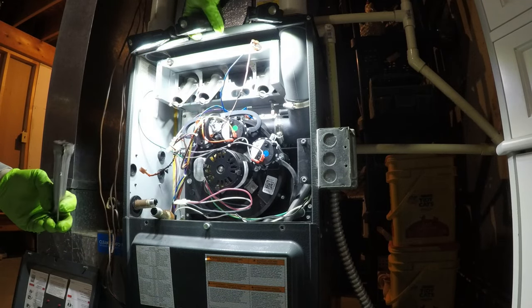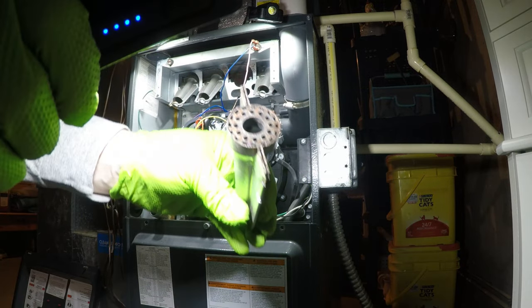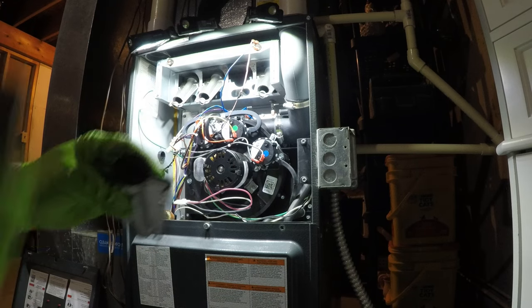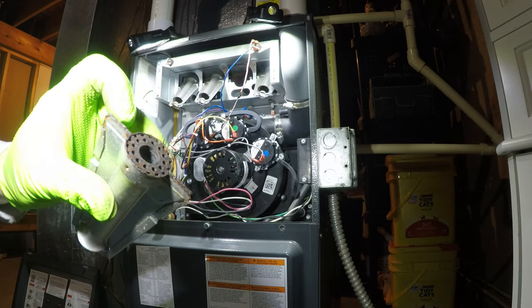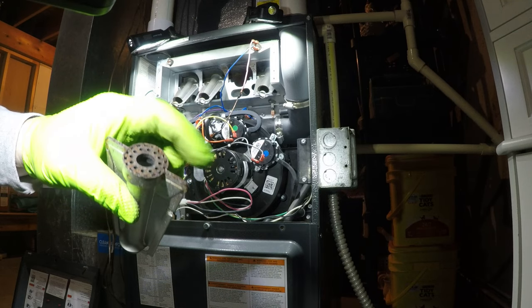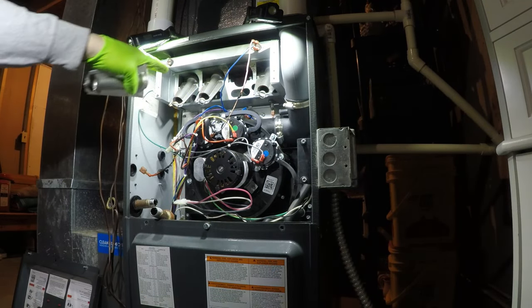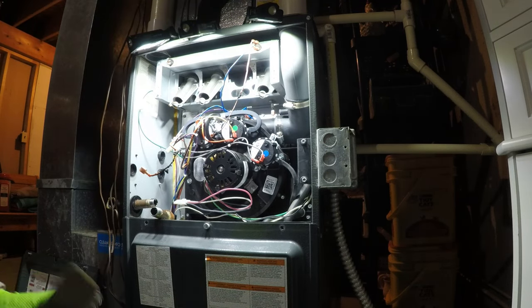Things are really crusty. Yeah, propane burns really wet. There's a lot of moisture in propane. So with these burners, as the gas rolls across, it lights these burners through here, ignites the gas around, and these are what you call travelers. And the gas goes across and it lights the burners all the way across, from the igniter all the way across over. And if these get plugged, you'll have issues.